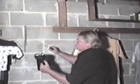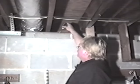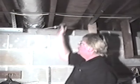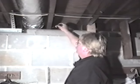Here in Georgia, the termites that we have come from the ground up into wood. Chances are they can travel through concrete, but normally they go from where there's ground to wood. So the first thing you'd want to do is come in here to the basement with your flashlight and come up. And up here is what's called the bottom plate. It's a 2x4 that goes along the top of your concrete foundation here. You want to go through the whole entire downstairs and check with your screwdriver, looking for rot or any kind of sawdust coming from any of these portions here.